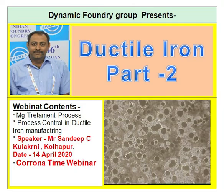Slogans, as I told you: always prefer CRC. Do not add carbon at the end. Keep CRC aside to maintain carbon percentage. At every transfer point, remove slag and add inoculation. Microstructure: by adding 0.2 to 0.8 copper, we can improve the percentage of pearlite. As I told you, copper is very important because it doesn't give you carbide. It is a pearlite promoter, and it gives good stability. So for pearlite grades, you prefer the copper percentage. Tin, as I told you, is not good.